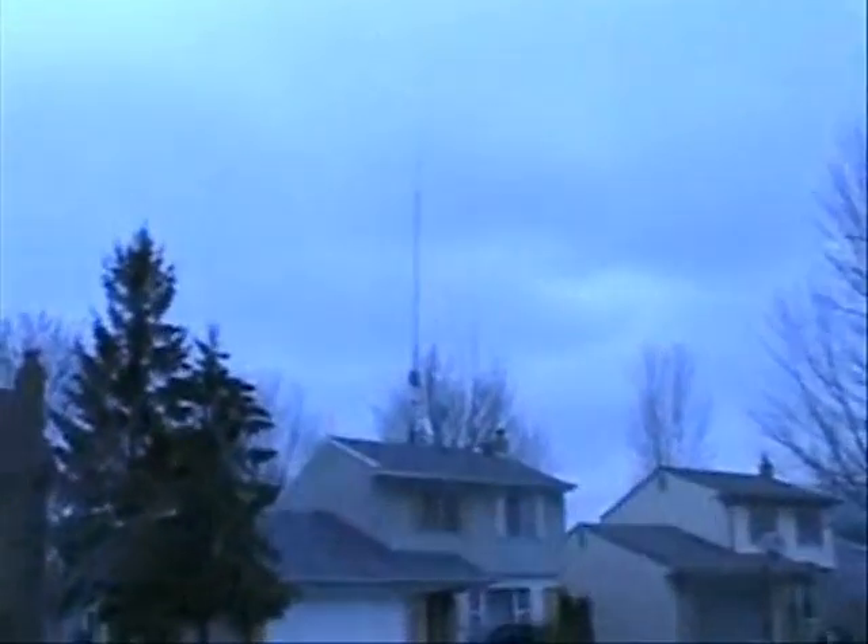What also helps is if you take this access point and hook it to a good quality antenna, such as this one here on my home. That's a directional antenna, but up here at about 55 feet is a 17-foot long, actually 19 dB gain, 802.11b — or actually 2.4 gigahertz — antenna. We're using it with one of these access points to help increase our range just a little bit. I should have used a tripod for this — I'm shaking like crazy, it's cold out here.